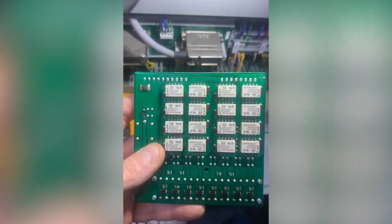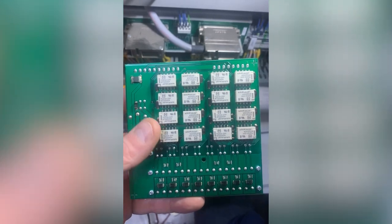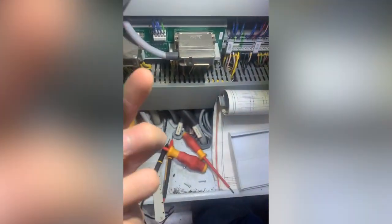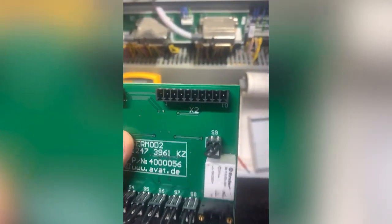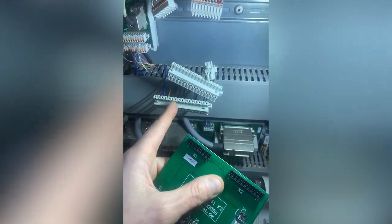But it acts as an I/O board, more of an AND or NOT type gate, a logic gate type thing. I'm not convinced it is this, because it looks to be in really good condition, but then again, these are quite well built with the Japanese relays. So, you can't keep running these machines and waiting for them to go off, but I could have at any point on this job stuck something back in that was a bit loose.